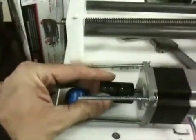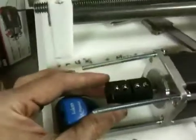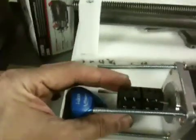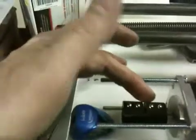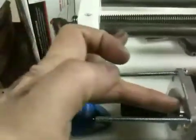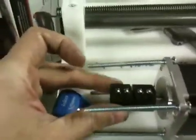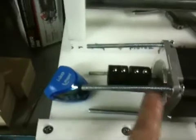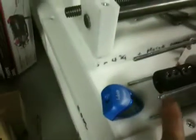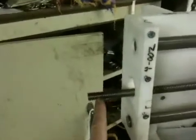Some screws sticking out of it. You can see it's a straight-through shaft — it's split right down the middle here, and split right there too. It has the screws going through it this way so they clamp onto the shaft. So these are all custom made. This one happens to have a quarter inch from here to here, and then from here to here is an ACME thread, which is the same as the rod.